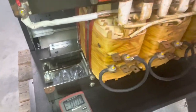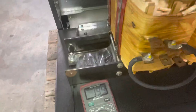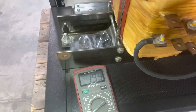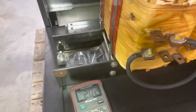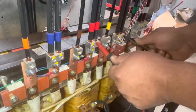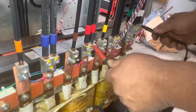The output is right over here — these two. You get about 200 or 199. Cross it over to these two and you get 202. And these two right here as well — this is a three-phase unit — you get 204. Then any leg measured with the neutral wire is going to give you 115 volts.